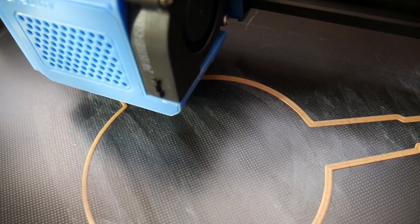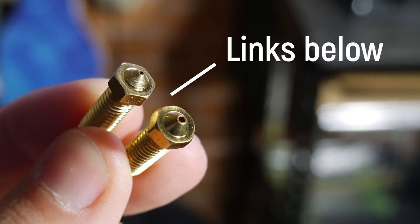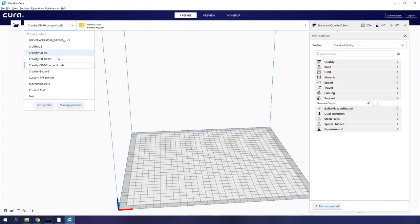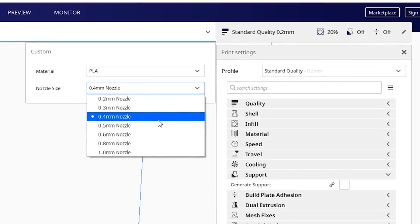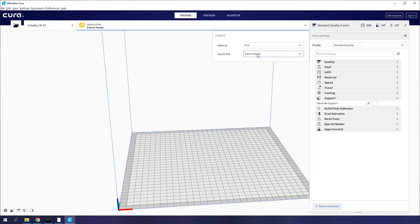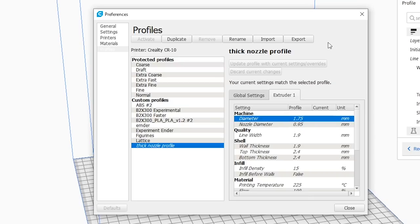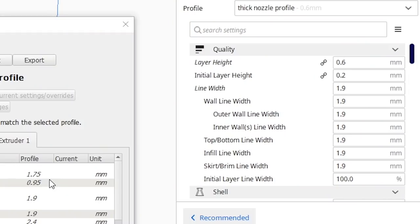Well, it turns out it's a bit more complicated than that. My first challenge was to dial this nozzle in, because I hand-drilled it, so the diameter isn't exactly 1mm — you can just buy 1mm nozzles, but here we are. I slowly extruded some filament to figure out what it was closer to and came up with 0.95mm. I then went to the latest Cura, which is 4.3 at the time of recording, and I couldn't enter a custom nozzle size — the option was just gone. There were discrete sizes to choose from, but I had to go back to Cura 4.0 to enter 0.95mm manually. I would love to be wrong here, so if you can enter a custom size in 4.3 please let me know.